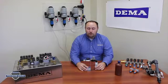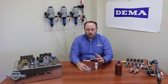to talk about the features and benefits and troubleshooting of the Watchguard reservoir-mounted float valve system. It is a completely mechanical design that the industry has come to know and love. It's a snap-acting float valve, and like with all snap-acting float valves, the common failure mode is the pilot valve getting stuck open. So we're going to talk today about how to repair that pilot valve.